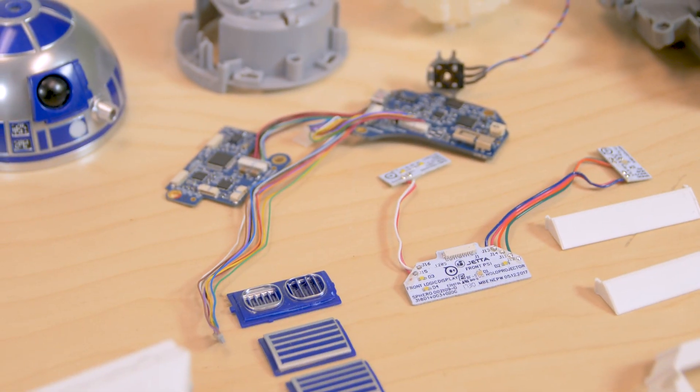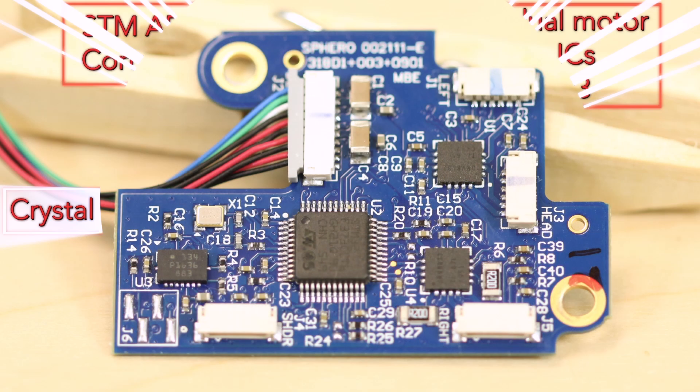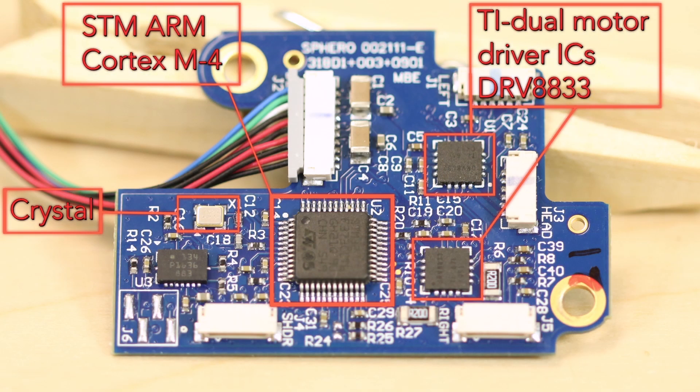Now we move on to the electronics that control all of the movement and sound effects. Two main boards hold most of the electronics, and three other smaller boards on the turret and main chassis hold LED indicators. One of the main boards holds an STM processor consisting of an ARM Cortex M4 core together with a DSP, a floating point unit, and a few other things. Near it sit two motor driver chips from Texas Instruments. Each driver chip can control two motors and can implement motor speed control through pulse width modulation — which makes sense because there are four motors on R2. Notably, while some motor driver chips handle velocity or position feedback signals, these don't, so the STM processor runs the feedback calculations for all four feedback loops.